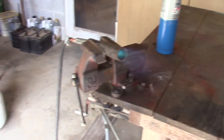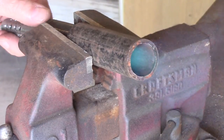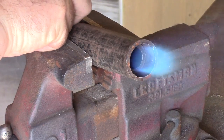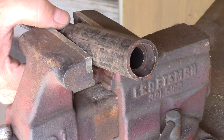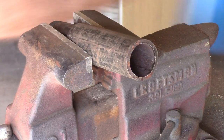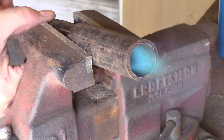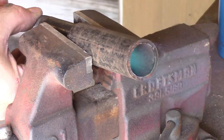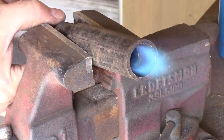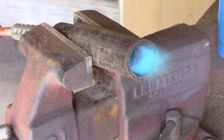Let me show you from this end as I advance the pipe. That change you saw was me covering up the air jets a little bit — you get a better mix. If you get too far out, you lose it. So there's kind of a zone in there. It was working really good around about an inch out. We're getting a pretty good flame — that's just a three-quarter-inch pipe slid inside of a one-inch pipe.